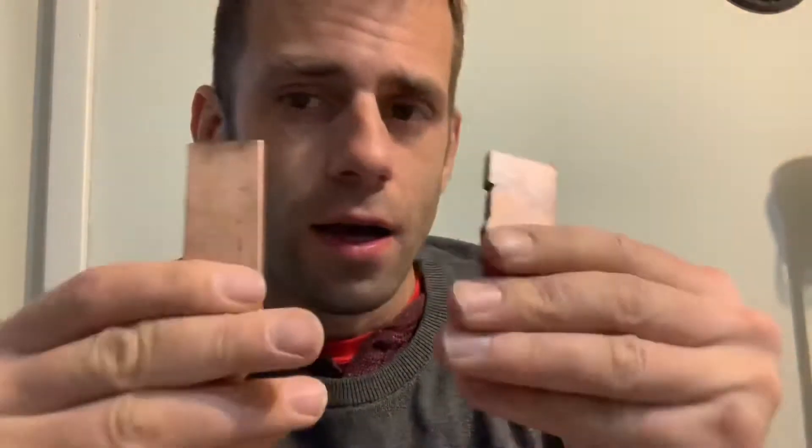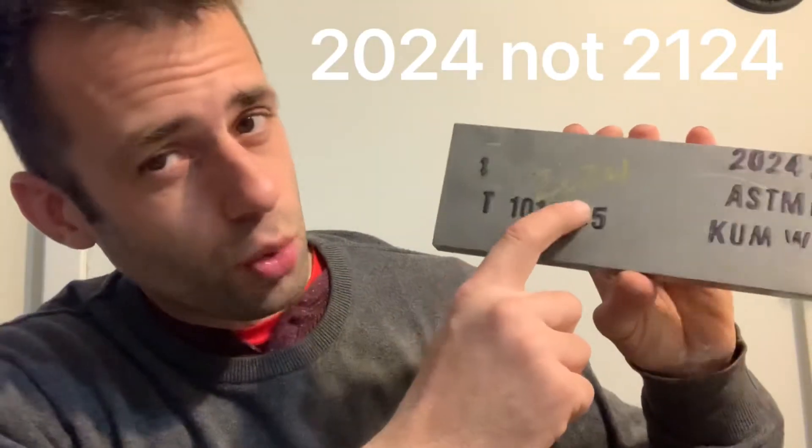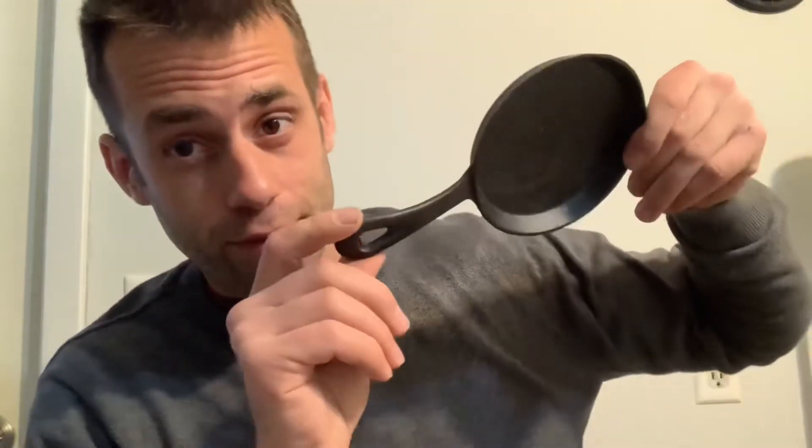Because I want the ratios to be fairly accurate, I have some pure copper plate scrap. I'm gonna be using 2024 aluminum — it's mostly pure aluminum but it's got a little bit of copper, I'm not quite sure how much. Based on what I'm reading I'm gonna assume five percent copper in this. And a cast iron pan that I got at the thrift store — this should be pure iron with maybe a little bit of silicon in there.